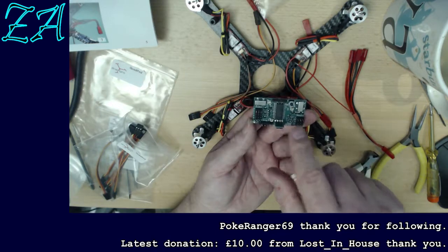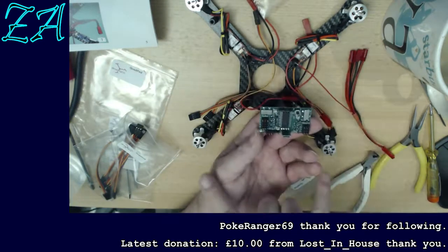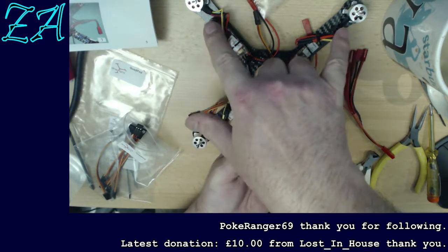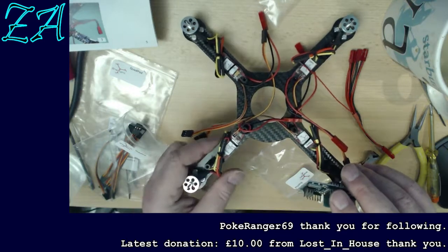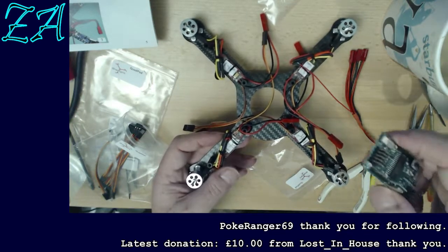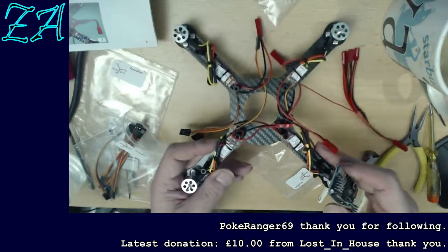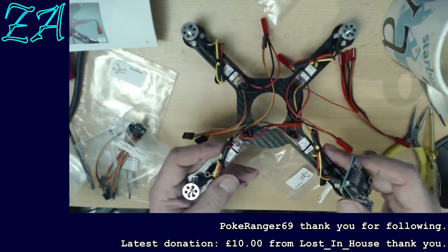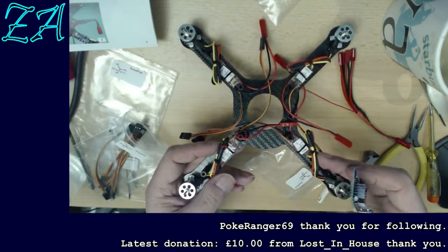But the other job of this is when I say go forward, which is that way, it will make these two rotors here spin faster for a short period, and then it'll make these two rotors at the front spin slower. And what happens then is it tips up like this. Now, because it's tipped up like this, the air that's blowing downwards is at an angle, so it's going to tend to drift in that direction, and the more tilted it is, the faster it's going to want to go. What it then does is turn the speed up of all four motors equally, and so you then get the speed.